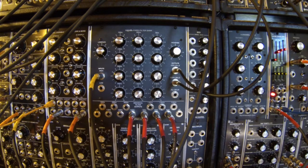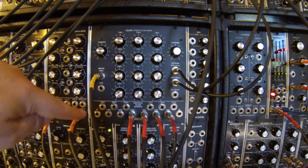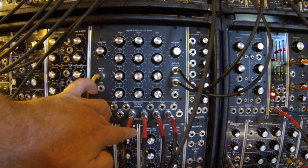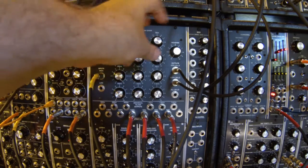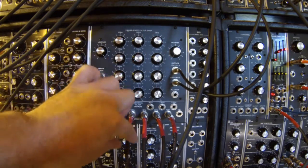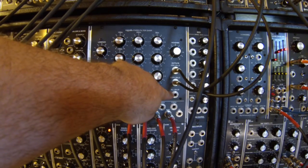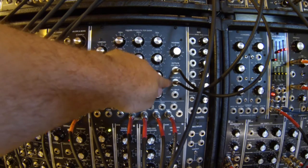What it is is a series of a dozen bandpass filters at different frequencies. One of the things that's really cool about this particular one is it has individual outputs for each of the bands. The way these work is that if you take something like the 750 Hz band, it's not affected by the 750 Hz pot, so you can make mixes of different bandpass filters to go out of the main outputs without interrupting the single output. There's also a master output of the entire filter bank, and outputs for just the odd-numbered cells and the even-numbered cells.